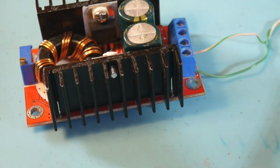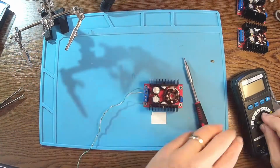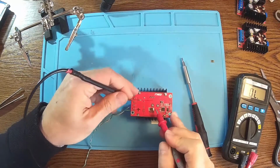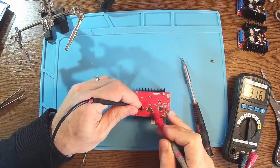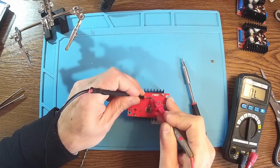It's looking like we have a short over there. We have a short for sure. The cables are really, really hot. Let's check for short. Yep, we have the power supply here. Okay, so this one it's burned. That's very clear. But let's see. Well, it's not exactly destroyed. It still has continuity. But now let's see what's happening over here.